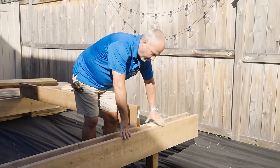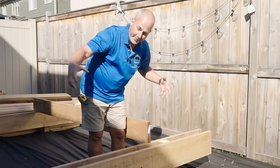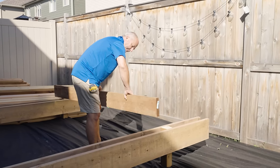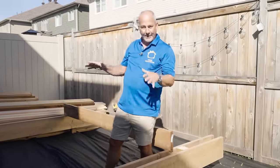Always looks like garbage. If you do it this way, you can recess this because you can cantilever using 2x10s, almost 2 feet after the block, okay? It gives you a lot more flexibility. It lets you work inside the confines of the perimeter so that you can make adjustments and you aren't gonna have ugly things to deal with later. So as long as your floor joists are on top of the 2x10s, we're gonna be fine. That's how you do your layout.